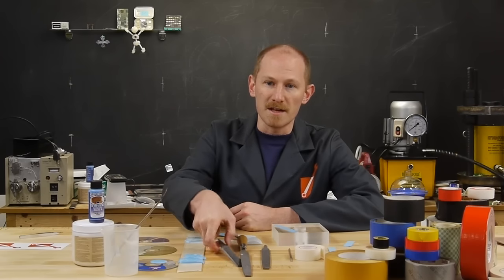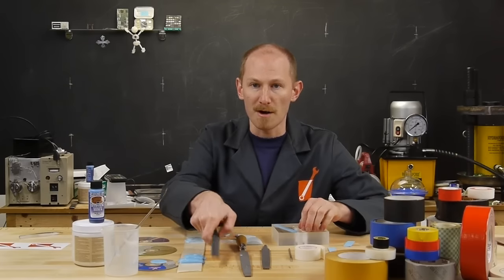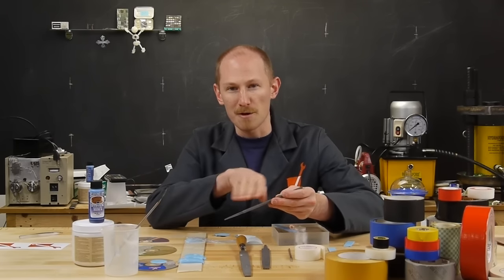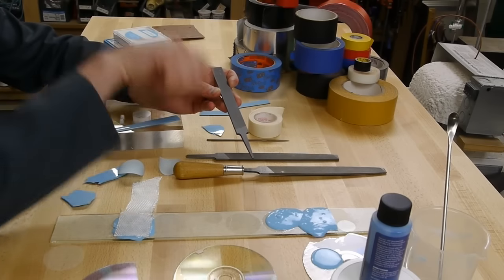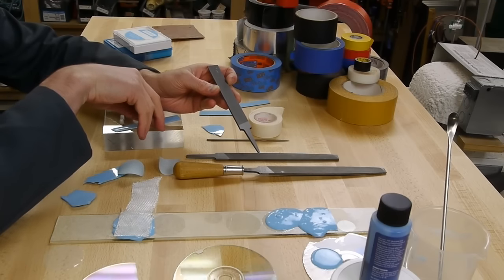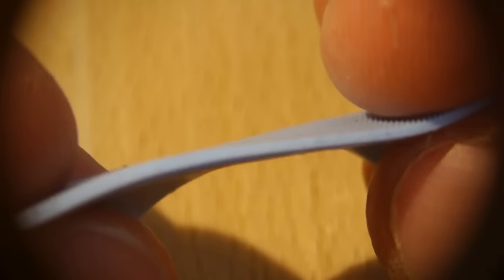After this I realized there's no way to get a metal file fine enough. Another problem is that the file teeth are sharp on the top, but since we're making a casting we actually want the tips to be sharp at the bottom - because when we peel off the casting, it's the tips of the cast pillars that interact with our surface, and those are formed by the bottom of the file valleys. Basically the manufacturing geometry isn't right for this purpose.